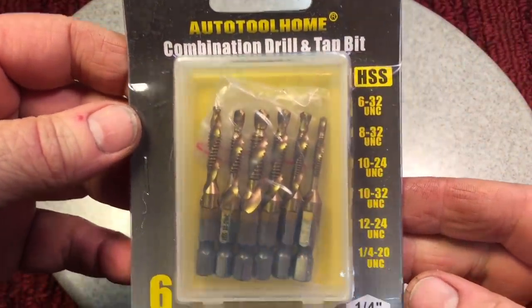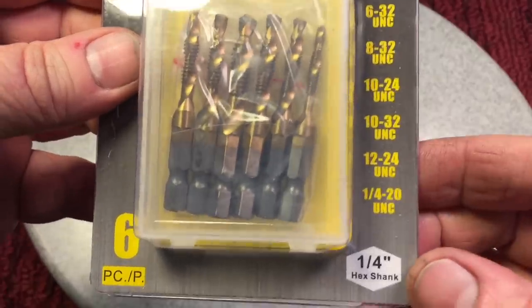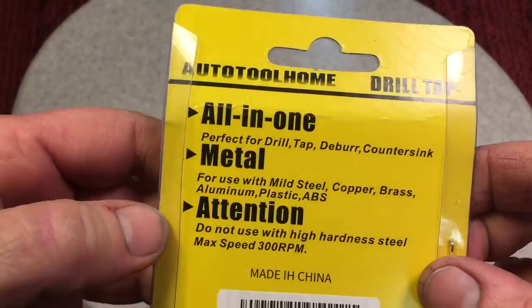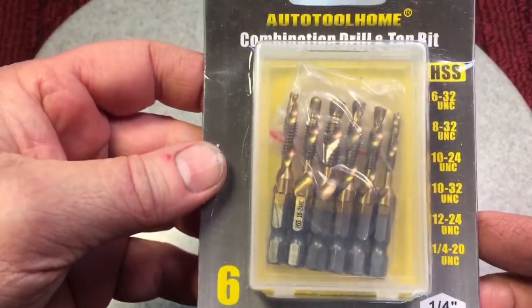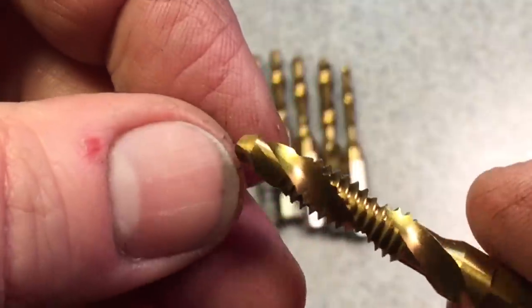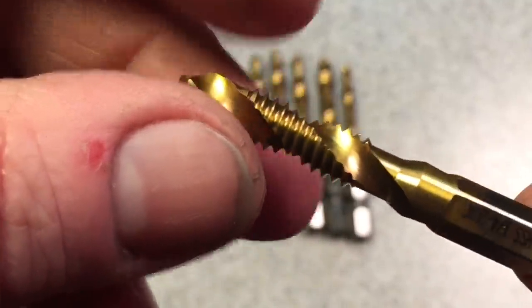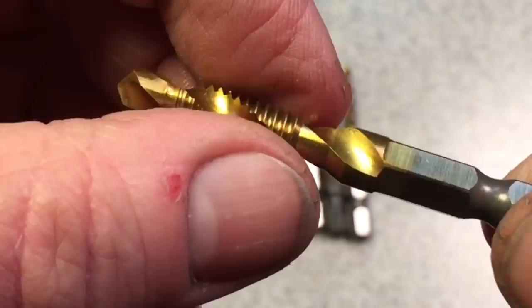Last week I picked up a few tools — drill tools, things like that. This one here is high-speed steel — I always love high-speed steel. These are the regular sizes here in the States, and what they are is a drill-tap combination. These are called combination bits, and when they say combination bits they're not kidding. First, it drills the hole to the proper size, then it taps it — in this case it's a quarter by 20. You can see it right here. And then you also have a small countersink back here that can give you a slight countersink if you're putting in a countersunk machine screw.